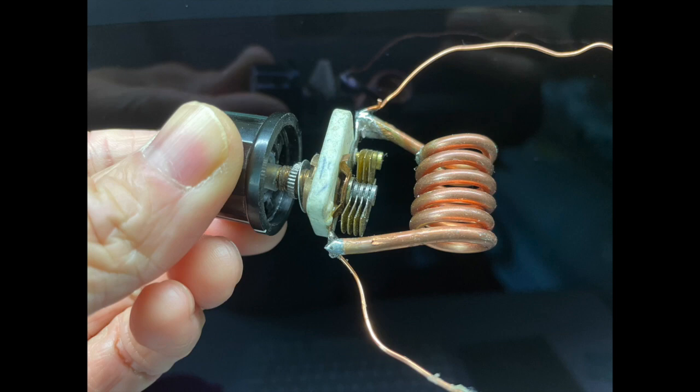Also, the wires used to connect different parts of the circuit together, between the detector and the LC resonant circuit, should be kept as short as possible, using thick wires instead of very thin wires.